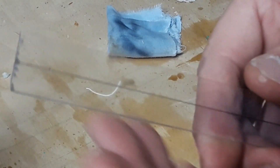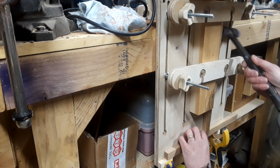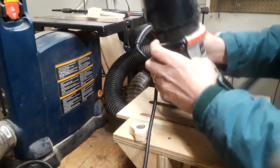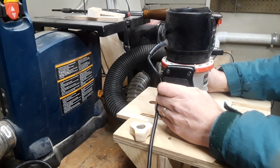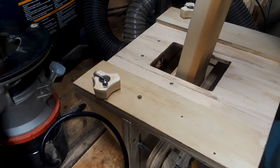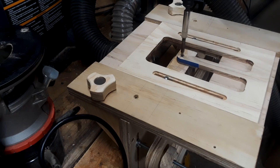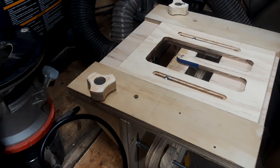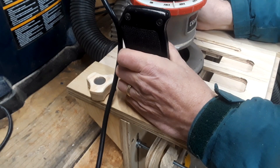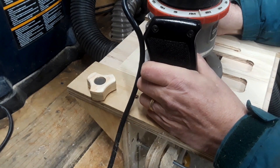I also rounded off the ends and screwed a piece of wood onto it giving me a handle. I had already made a square to help plumb the workpiece. My new plastic template made it easy to line up with the center line scribed on the test piece. Then came the aha moment: I realized the mortise template comes in from one side of the jig, and the tenon template comes in from the other direction. Having both templates come in from the same side means that if your template or jig is off at all, you will be doubling the error. This way, any error is counteracted when you bring in your second template from the other direction.